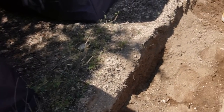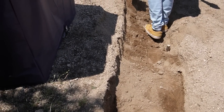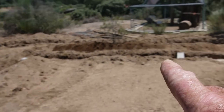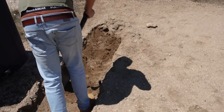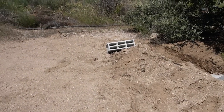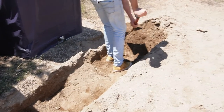We've got a big chunk of granite here in the way. And Miguel's widening it because this end of the trench is 4 meters 600. This end is 4 meters. So we've got a big wide trench here and we've widened it there the other way. So if we gain 300 mil each end, we can lose a bit off that end. So basically we can square it off quite easily.